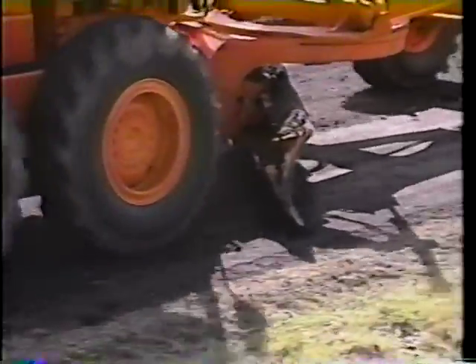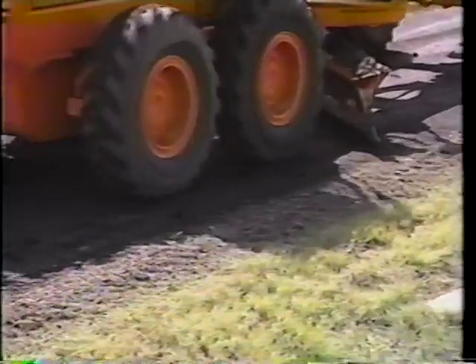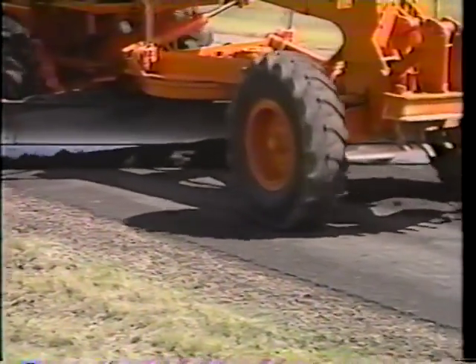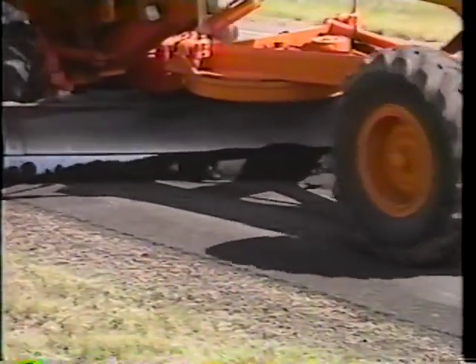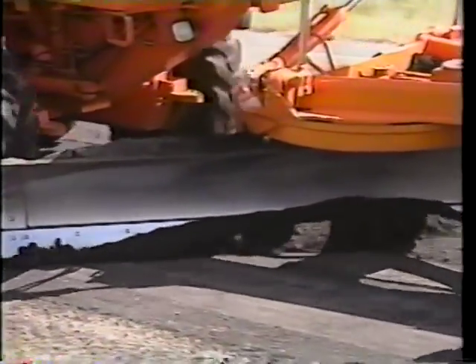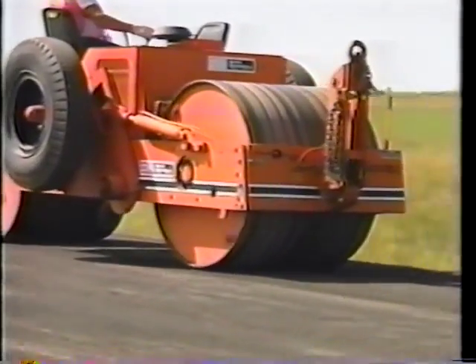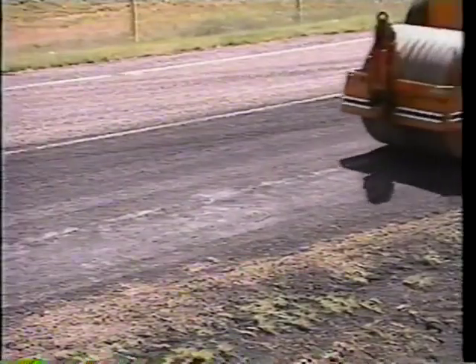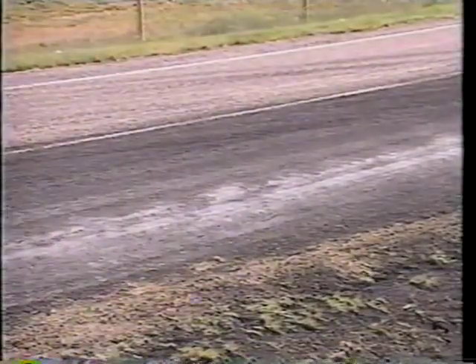During the finish lift, no more adjustments than necessary are made. The number of passes is determined by the width of the patch area. The material should run out just before reaching the end of the patch, and there will be no pile left. A very small amount of material should roll off the edge along with the chunks — this will assure that all drag marks can be filled and the surface will be even clear across the patch. If material does not come out all the way, it will leave lines running in and out, which are called scallops. Rolling down the chunks along the edge leaves a good appearance to the patch.